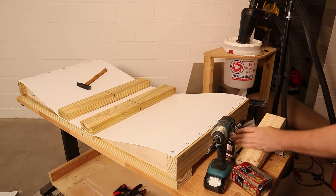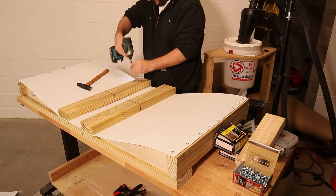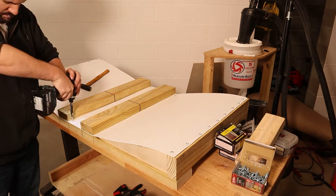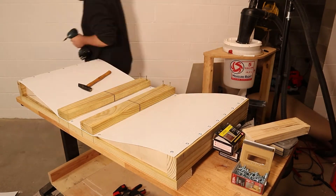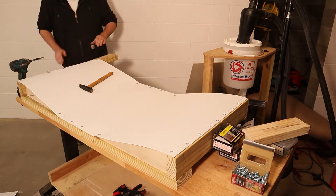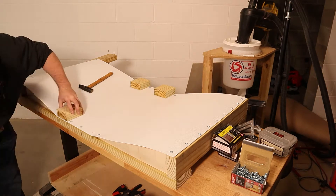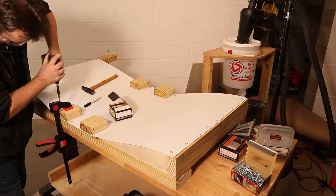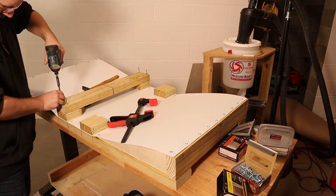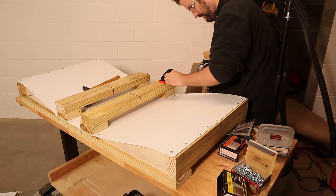In the very middle is where our drain plug is going to be. I've used those 2x4s temporarily to get the whole layout put down — I'm going to take them off now. We're going to have to space them up so that the runoff of all the coolant, water, or whatever it is can drain towards the middle. That's why we have that curve there. These four 2x4 blocks are just going to space up those two longer 2x4s, so now I have a place for the coolant to drip through towards the middle.